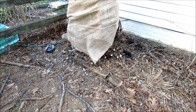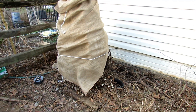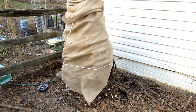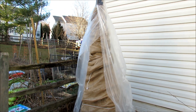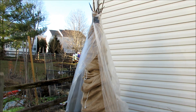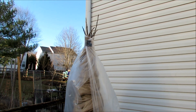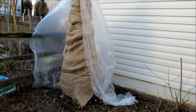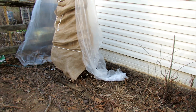And then when the tarp goes on, I'll take care of the bottom. You want to make it sealed so that the wind doesn't blow underneath and pull out any of the warm air or bring in any cold air. This is really a two-person project if you don't want to get frustrated, but you can do it with one person. When you put the plastic on, just open it up, have some duct tape already peeled off and stick it onto your arm or something, and just start at the top again. Duct tape the top and then overlap it at the bottom — leave the excess plastic at the bottom to keep that wind from blowing underneath.